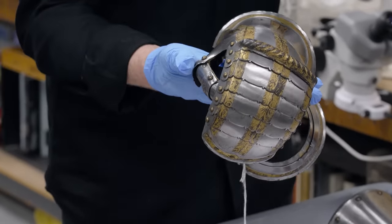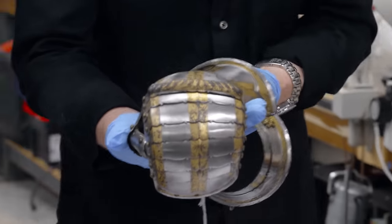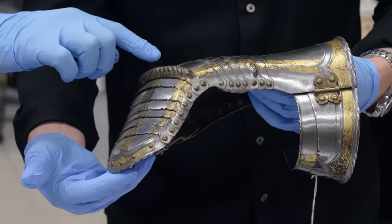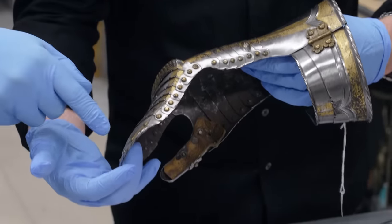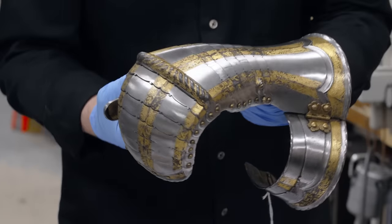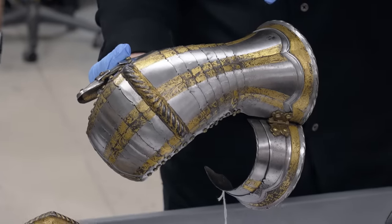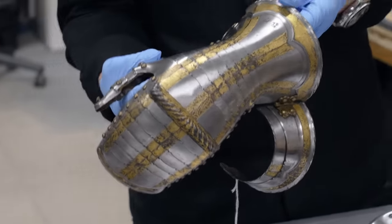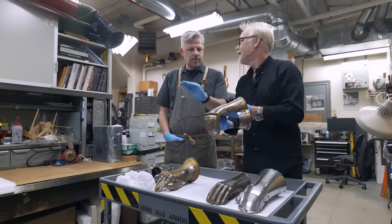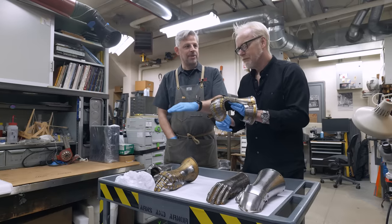They were using acid for those patterns — you would paint on a resist and scrape it away, or sometimes paint on the resist and dip the whole piece of steel. And then the gilding is applied — it's amalgam gilding, it's mercury and gold, fused on with heat. Really healthy stuff. I love the armorers' marks — super important for us to research and track who's making what. You know who made it and then you can work out where they made it, and you can go in the archives and find out when they made it and how much they were paid for it, because you can find the receipts.